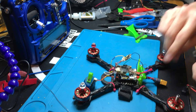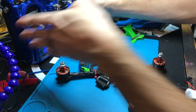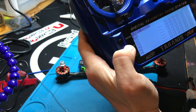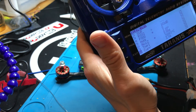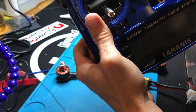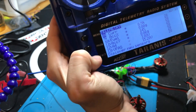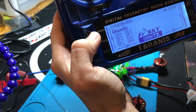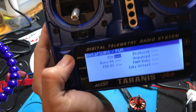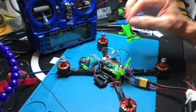All connected. I'm going to turn on the radio. Going into the telemetry menu — I'm getting all this good stuff in here. It wasn't before until I hit 'discover new sensors' — accelerometer, all that stuff. After stopping discovery, you can see all the things that got picked up: current draw and more. And if I go to the PID screen, you can see I've got PIDs here. That is all happening on the RXSR running into the Omnibus F4 Pro V3.